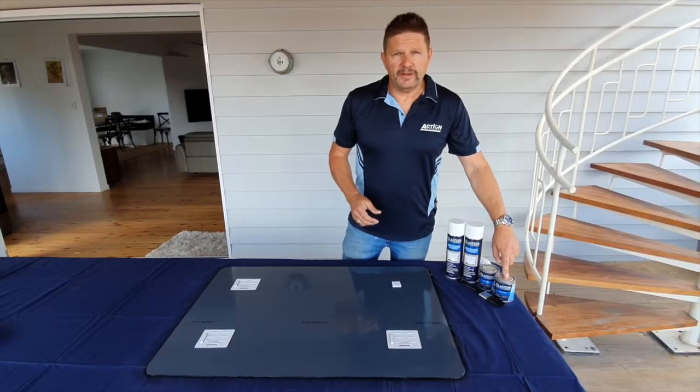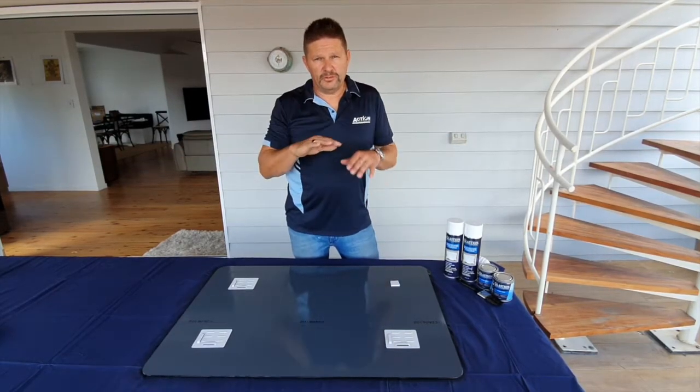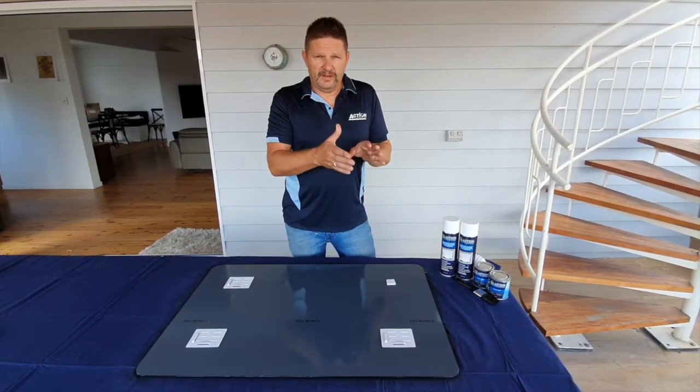The other option is if you don't want to do the whole back of the mirror, or you've got laminated glass, you would only need the liquid — just run along that exposed edge to waterproof the glass and the interlayer.